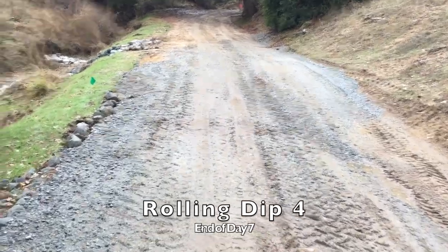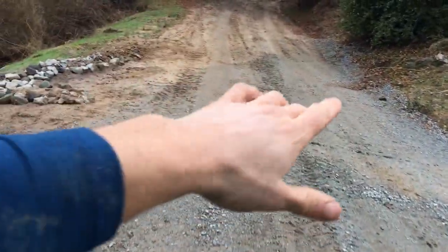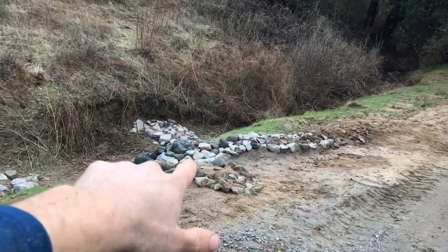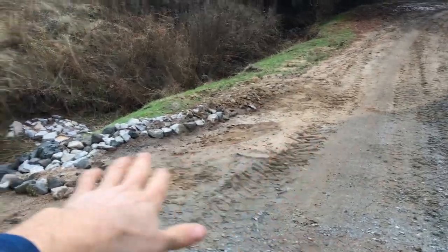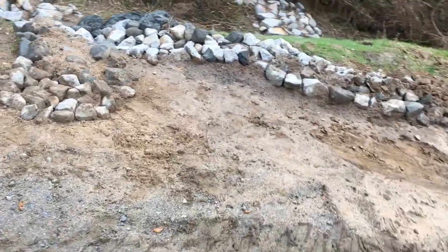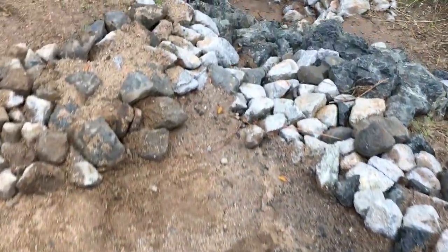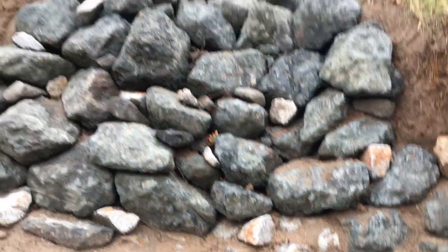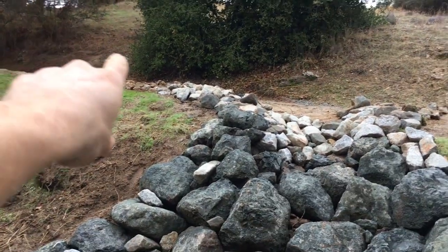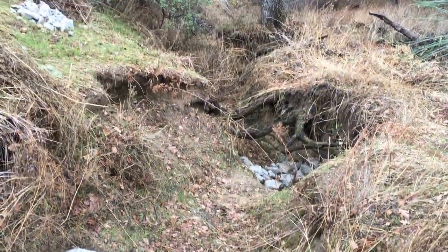This is Rolling Dip 4 — we're walking up the rollout right now, super subtle this one. This whole area used to puddle, so basically what we did is cut a four percent drain from this point over to here. It's still pretty shallow for a rolling dip, but water has a way out. Then we created a nice rock-lined rundown, a little catcher's arm just in case of a high flow event, and large rocks all knitted together super tight. Here's the view from the bottom — water comes out of this rolling dip, crosses the roadway, transits down right into Zuni Bowl 6, has a nice sill, and then continues on back down the drainage.